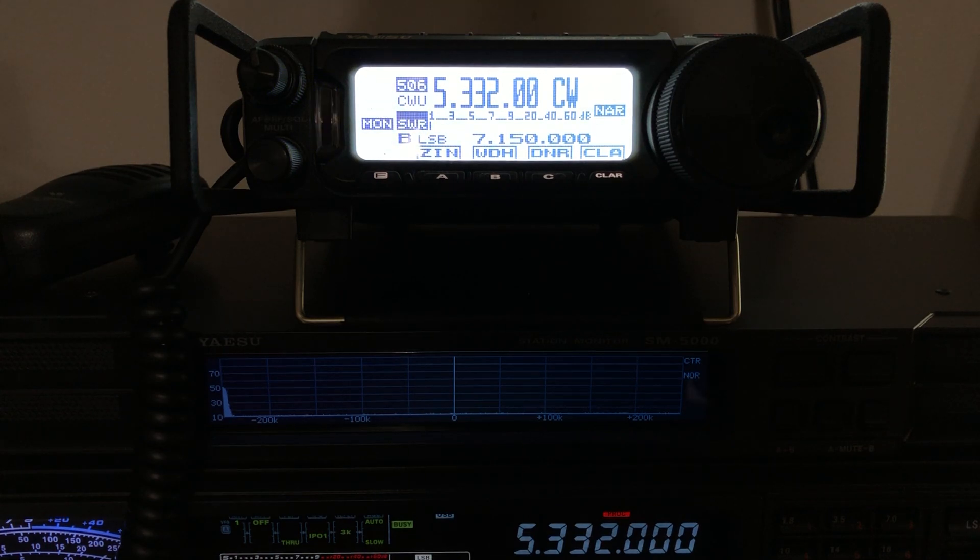Many radios from the past shipped with a default transmit bandwidth of 2.8 kilohertz, and I think that's a reasonable bandwidth — audio quality sounds pretty good at 2.8. We're not trying to sound like a disc jockey on an FM music station. Too much low end uses up a lot of energy that could otherwise be shifted into areas of the audio spectrum that help you cut through pileups. That's why you'll hear people thin out their audio in DX — you get a little more use of the power you have that way.